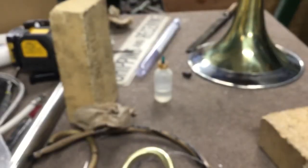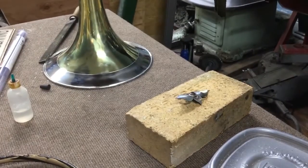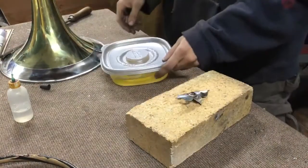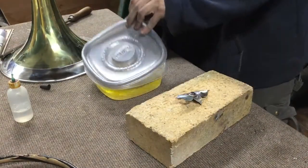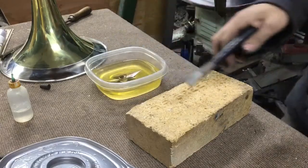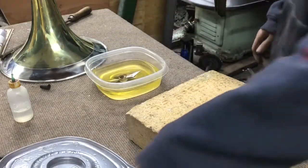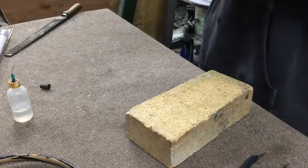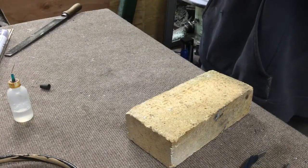So I have a little pickle — I have a big tub of this at home but haven't brought it here yet. This is a milk stone remover from Tractor Supply. It's just phosphoric acid and a degreaser, which I like. It's cheap too. Let that sit in there for about seven days and you'll get it good. Rinse this off, get the flux off of there — because I am sick of touching flux. Very sick of touching flux.